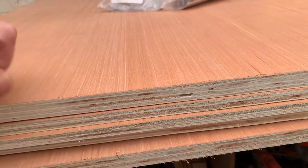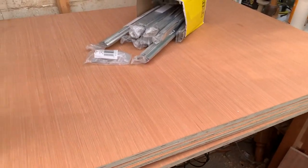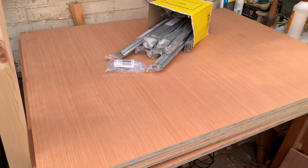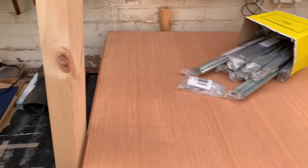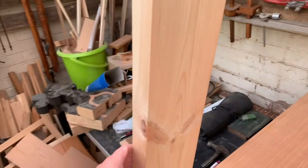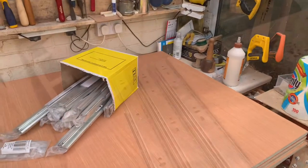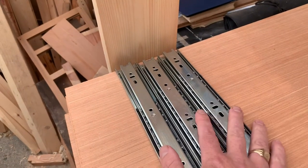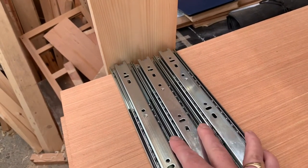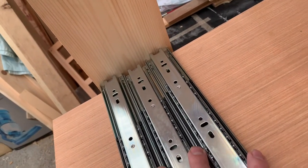Those drawer sections are 12 mil. So the top and bottom portions will stay that big, and the individual sections in between will get cut up for their individual parts. We also needed a big 6 by 2 chunk that's going to become the edges. My first concern was that the three stages of draw runners we need were going to be too wide for that six inch beam, but they do fit — just.